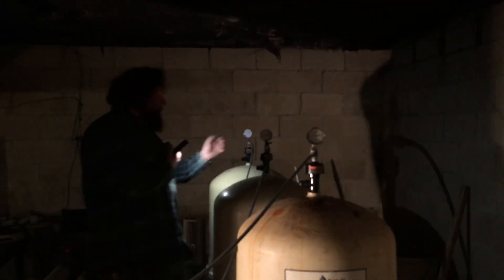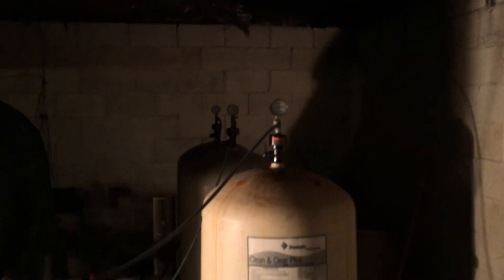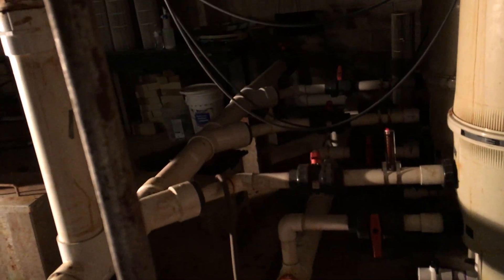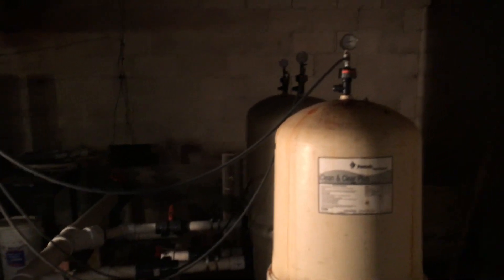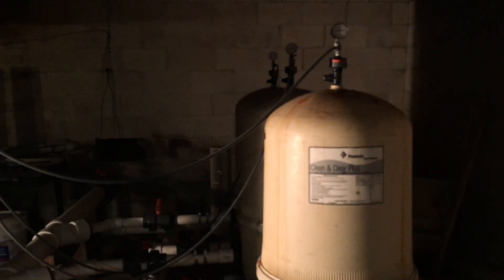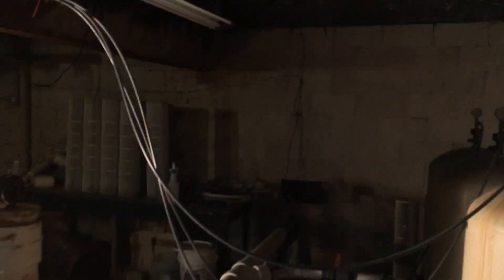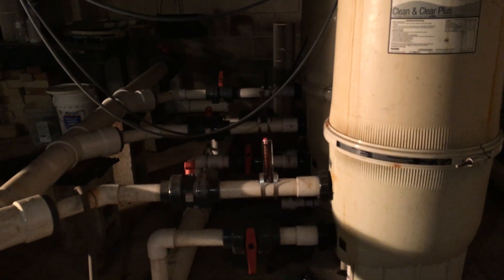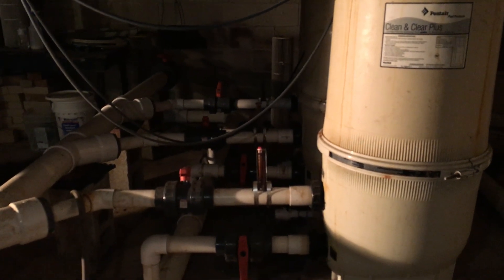When the water is on, you turn the valves down here — make sure those are open so water comes out, then close them back down. I would start with the far one, open the bottom one first, then the top one. You'll hear all the air rushing out, and as soon as the water comes out, give it a quarter turn and it closes.